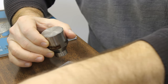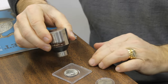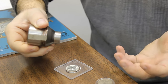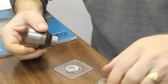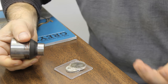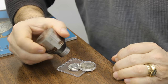Anything can happen. So if you get a coin that is just not seated properly inside that collar die — you can see it's off just a little bit — and it strikes it, then you're going to have out-of-collar. Sometimes it will be 50% or more. If you get another coin that comes in and gets struck onto it, then you've got an indent, a brockage.